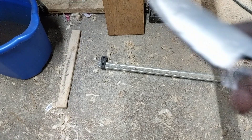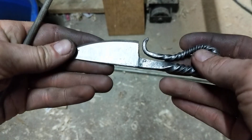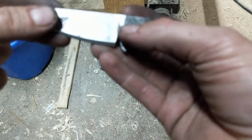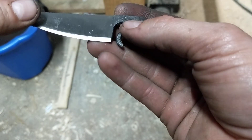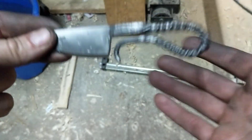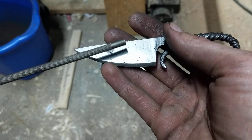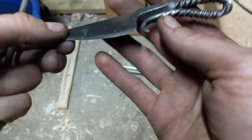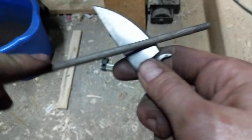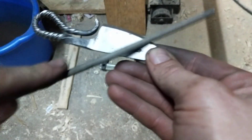Alright, JD here again. We've got this little knife that we carburized. Last time you saw it was in a YouTube short, and the surface was dotted with blisters — there's still evidence of one right there that I didn't grind out, just leaving it as an artifact. I used my little one-inch by 30-inch belt grinder to clean the bevels up. I heat treated this, quenched it in hot peanut oil, then used the belt grinder to reestablish the grind and get it to a sharp edge. I did not temper this yet, but it is hard — carburizing mild steel was a huge success.